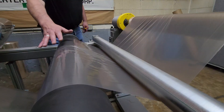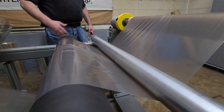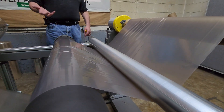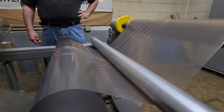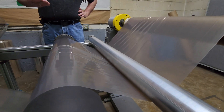And if you keep running, you're going to see now there's another wrinkle here — wrinkles are forming in that section. See all these wrinkles right here. Before, when the wrinkle stop was adjusted, it took those out. So now you can see what the wrinkle stop does.